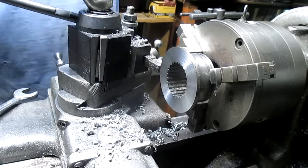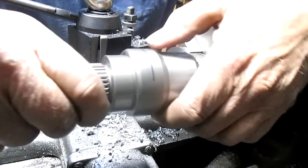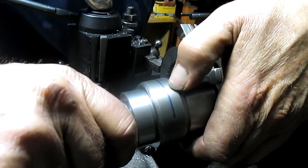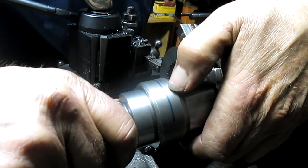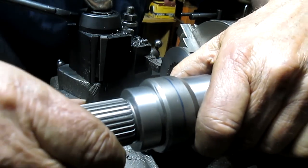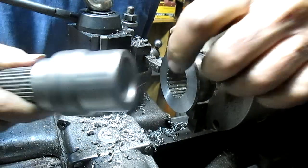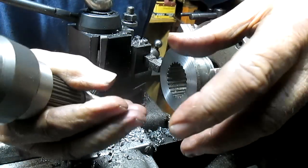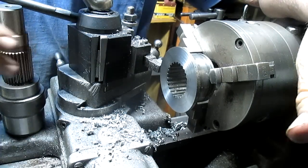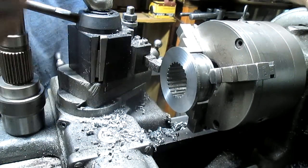Okay. So that means we come in just a little bit, like an eighth of an inch this side of the line, and we'll cut that off and square it and throw this part away, and this part will go up against this part, and there'll be plenty of room to do a male-female mating. So let's take this over to the big lathe, because this little guy's, you know, weak as a kitten.